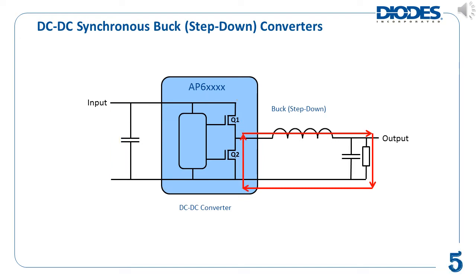In the next part of the switching cycle, Q1 turns off and Q2 turns on. The direction of current flow in this configuration is shown as red arrows on the slide. During the time when Q2 is on, the inductor current decreases and is initially still supplying current to the output load and capacitor. Once the inductor's energy decreases enough, the output capacitor takes over, using up its stored energy and supplies current to the load. When this part of the cycle ends, the beginning of the next cycle starts with Q2 turning off and Q1 turning on. This sequence repeats every cycle.